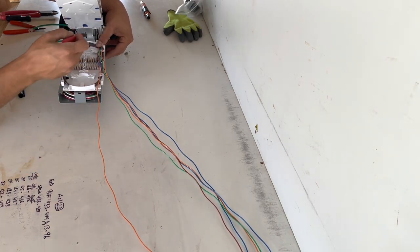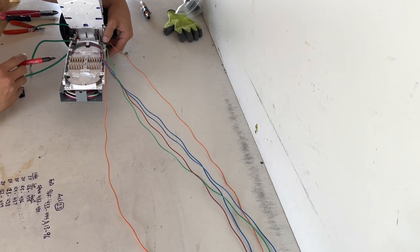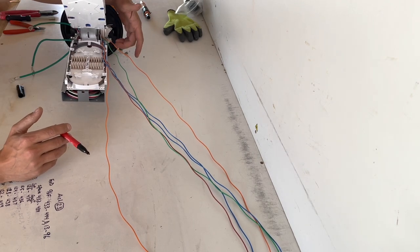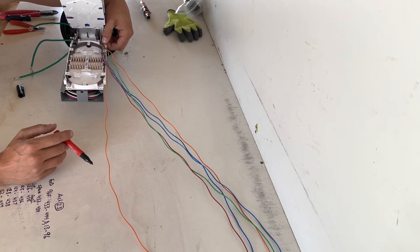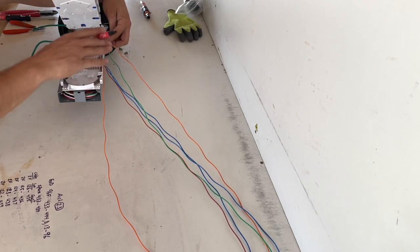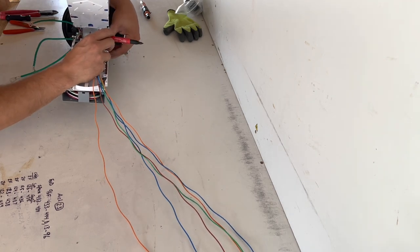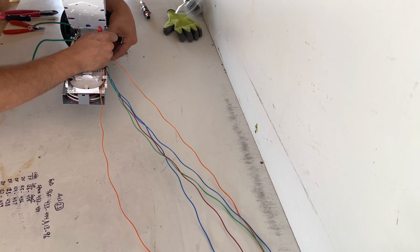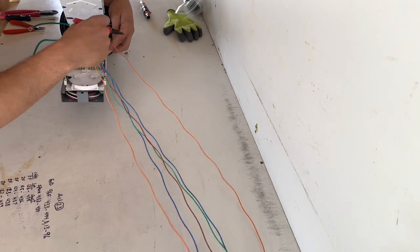But you're gonna wanna go ahead and come in here and make a mark. When I mark my tubes, I'm always marking them to the inside of the tray. You never mark them back here, because whenever a tray lifts, there's gonna have to be some slack that pulls forward and back. And if the ring cut's too far back, you can run into the tray and the tube popping out here, and when it gets laid back down, it pushes forward and actually snaps fibers. So you wanna ensure that you're marking them ahead, so you don't ever run into that.